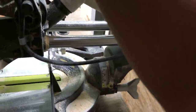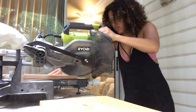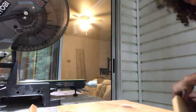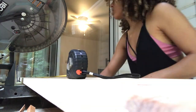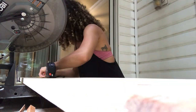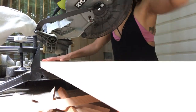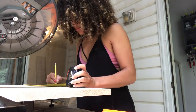For the shell of my nightstands I made 45 degree angle bevel cuts. I wanted it to look really streamlined — I could have just had flat end cuts but I just wanted to be extra. I learned how to do bevel cuts and I just haven't stopped since. I'm cutting a 1 by 12 piece of wood into four 18 inch pieces and four 12 inch pieces. That'll give me the shells of both of the nightstands.